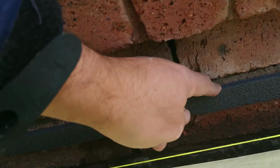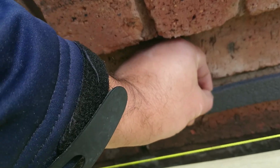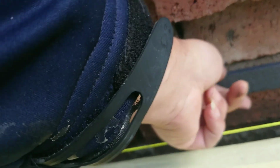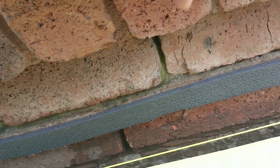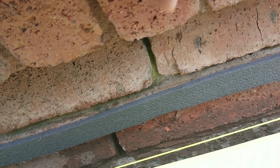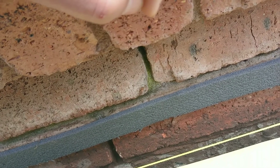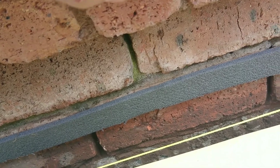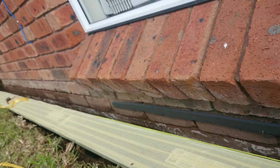So when I put this one here, then when the concrete is poured 24 hours later, I'll peel this one off. Basically I'll take it off, I'll dig it out. It's very easy to dig it out anyway. And I use any kind of caulking product. It's a flexible caulking product in there, so that when there is a shrinkage, which is expected, shrinkage of the concrete, at least that caulking product would still seal that joint. So it's gonna go all the way. So I would continue to do that all the way to the end.